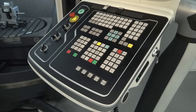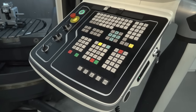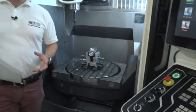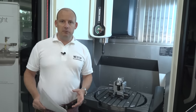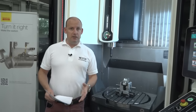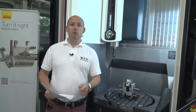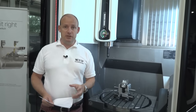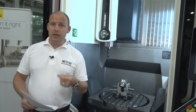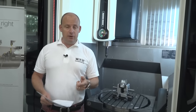So this is a Siemens control, and this is a full five-axis machining centre — full simultaneous five-axis machining. It's a DMU 75 monoblock or the 95, and both machines are built to the package and specification described. Swarf extraction goes out the back. There are two or three minor options: through-spindle coolant, tool measuring, mist extraction, and 3D quick set.